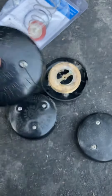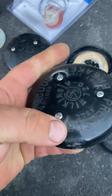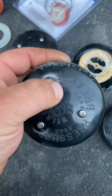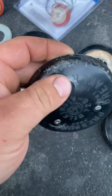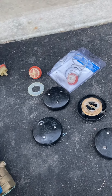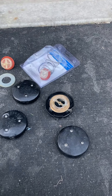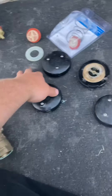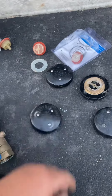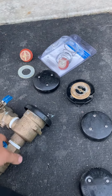There you go. If you're watching the 720A's, even if you see them just off-center or a little bit off on the discoloration or whatever, that's because they need to be serviced — they froze. Freezing territories, which is everywhere, including Texas. So a little something to be looking out for when you go. I usually visually check the backflow because we blow them out before I put the plug in or while I'm putting the plug in.